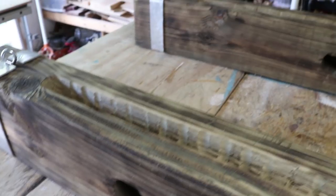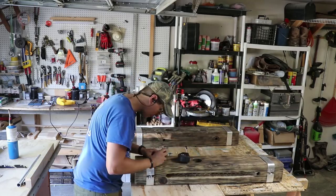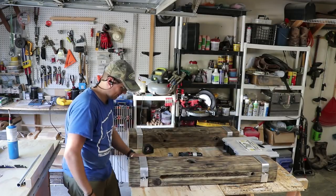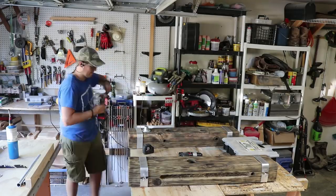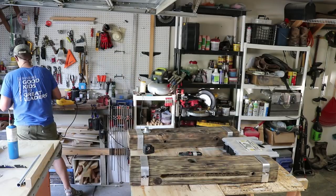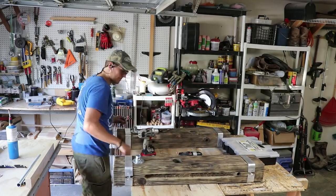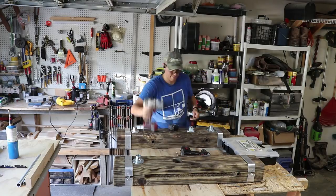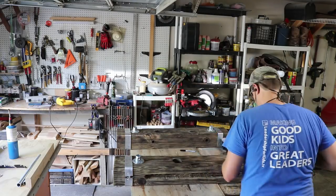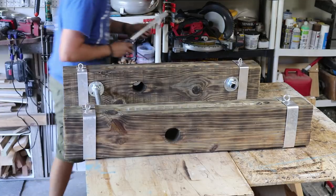Start the eye lag bolt with your hands and then as it gets tighter use a screwdriver or something similar to get it to screw all the way down into the wood. Now that the banding and the eye bolts are all in place, I moved on to the hardware going in between the two beams to separate them. I started by cutting my pipes to length, which was 18 inches, then measured the beams for exact center on the side so I could put my pipe fittings on. I simply set the fittings against the metal band, marked where the holes were going to be, pre-drilled the holes, and ran the screws back through the fitting into the beam. Since I'm a little OCD, I made sure that all the allen set screws on the fittings were facing toward the top of the beam and couldn't be seen from the ground. Once you have all the pipe fittings secured, go ahead and put your pipe in between them and secure it in place with your allen wrench.